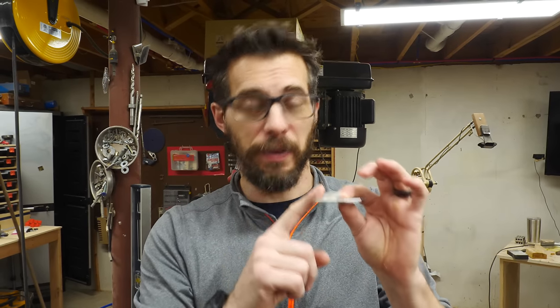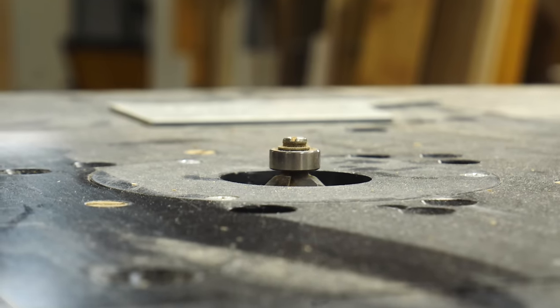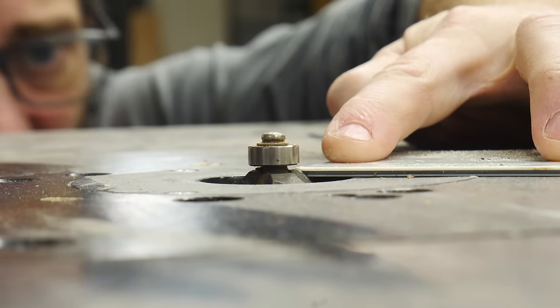I didn't order a specialized bit to put the chamfer on the pickguard because I already had chamfering bits and I figured they would work. Well, it turns out that the gap in between the bearing and the actual cutting edge is bigger than this material. So I'm not gonna have any luck using those bits,